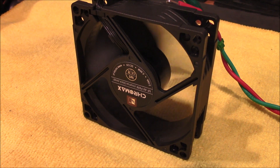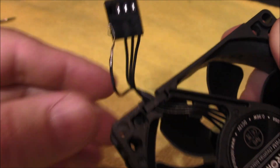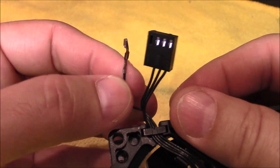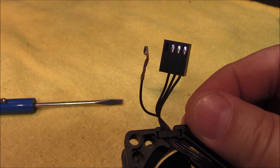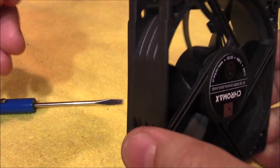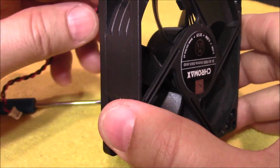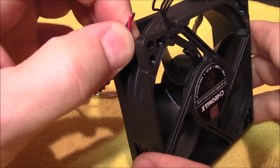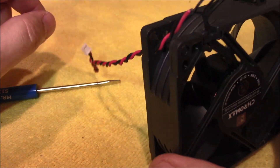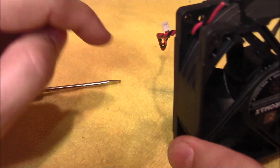Here's the new fan. As you can see, I just used a small screwdriver and I pressed down on one of the pins and I was able to slide number one — the negative wire — right out. I'm going to trim this up a little bit, but actually solder this directly to that. Now one very important step, if you decide to choose this method, is to use the bottom hole and simply pass the wires through. Make sure it's facing the right orientation. Pass these wires through here like so. And then you can solder it up and heat shrink it, tie wrap, whatever you want to do, but make sure it's nice and neat and it sits right in here or else there'll be interference as you install. But this cable has to come through that bottom hole as it goes into the radio.